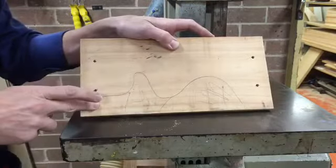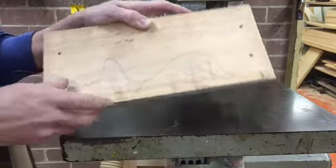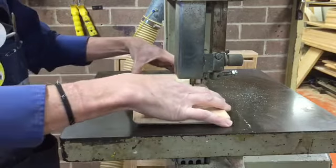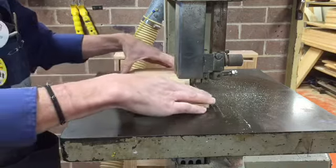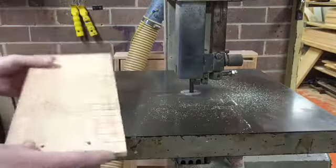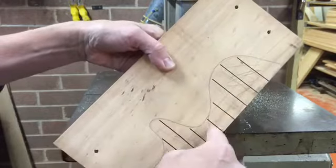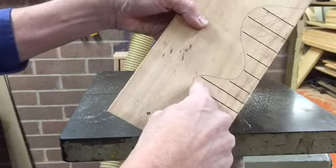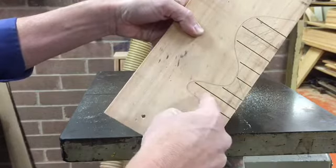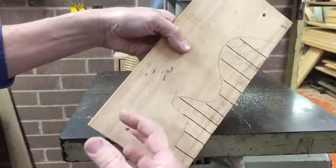To demonstrate what I meant with cutting out this area, I'll do this section so you can see the thought process of cutting out using relief cuts and not trying to do the whole thing in one go. Once I've done all these relief cuts I can now follow my curve around. In sections where it gets very steep, you want to be really careful. One thing with the bandsaw is if you're doing a long curve you can't back it out, because if you try to pull the timber back out of a long curve there's a good chance you could pull the blade right off the saw.